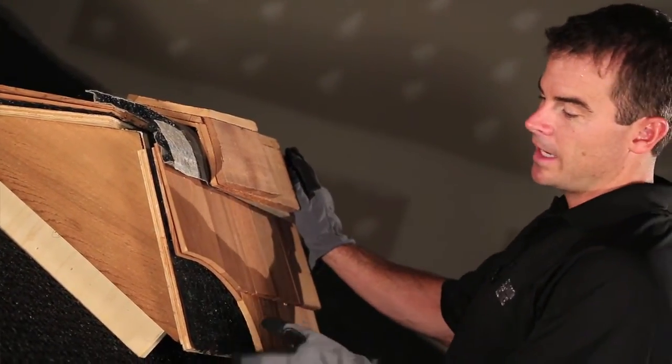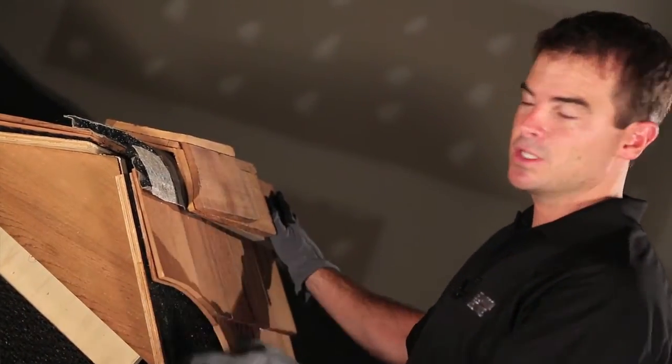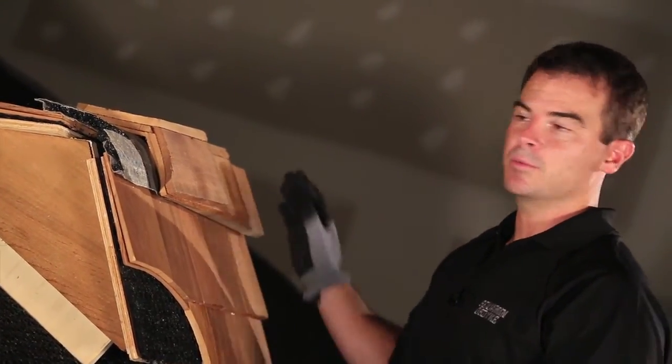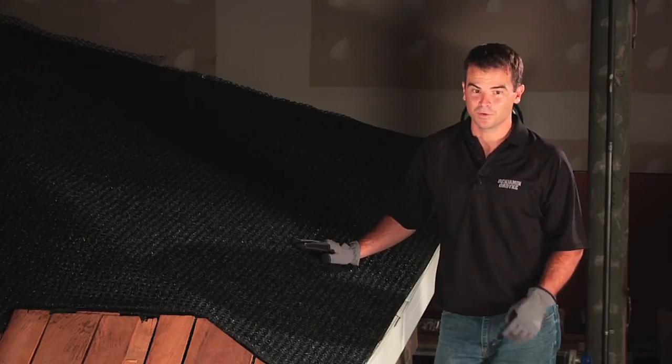After the installation of all the shingles, make sure that you have an opening. Leave the opening at the rake location and at the eaves — that enhances the airflow underneath the roof assembly. Thanks for joining us. For more information, please refer to our website at benjaminobdyke.com. See you next time as we strive to help you build better.